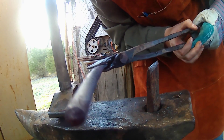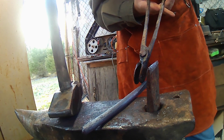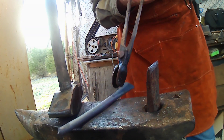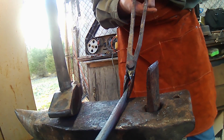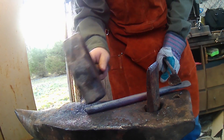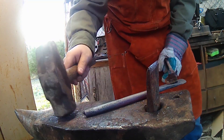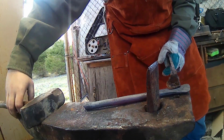She's cut off. We're going to true that up a little bit. We're going to give our handle here a bit of shape — instead of just round, we're going to straighten it up a bit more, taper out our striking end, and kind of rectangle this off slightly to make it more ovular, to be a little bit better fitting in the hand.